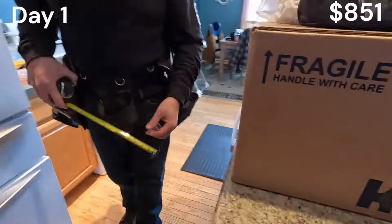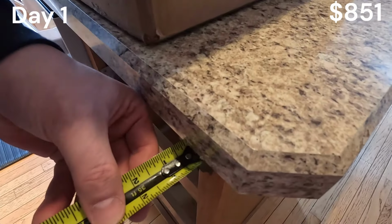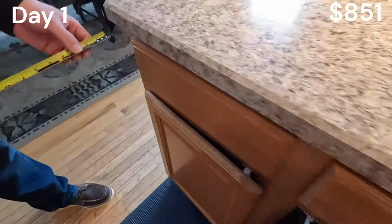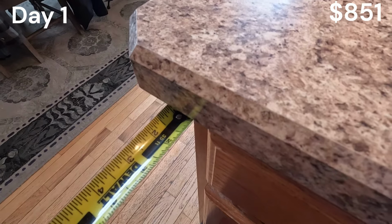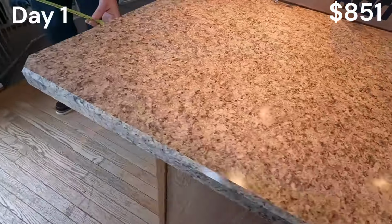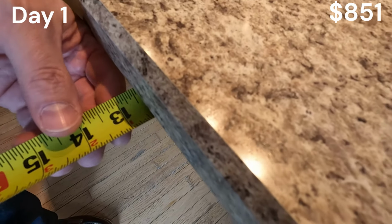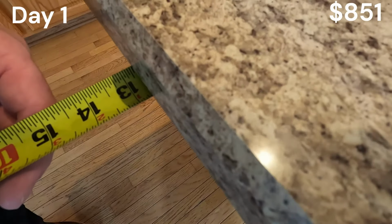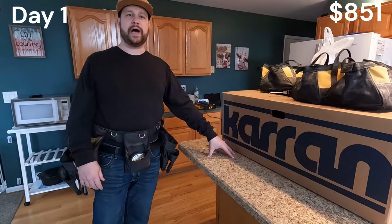Next, since this is an island and we can only go off the back, but we're gonna go off the front. We got the front set at 1 1/8 inch. All you do, go to the other end. We can see that we are perfectly one and 1/8 inch. So we know just by those three being centered, if we do the same back here, we've got 12 5/8. Same thing, 12 5/8. That's how you center your new island when you put it on.